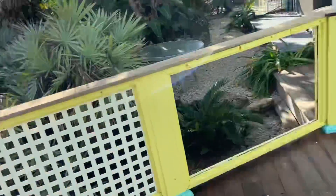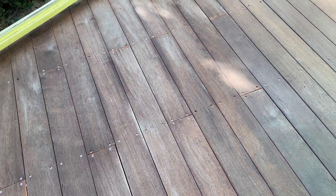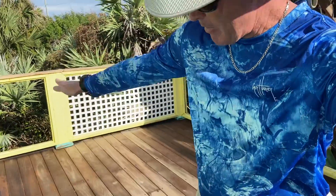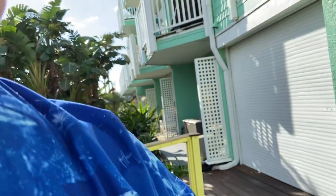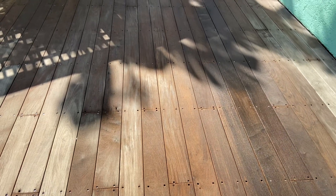The metasilicate just makes this wood look brand new. Now this is a Brazilian hardwood — it's very hard and you don't want to run a pressure cleaner on here, because even if you're doing a sweeping motion, you don't want any stop-start marks, you don't want to fur the wood. You want to make this wood look absolutely beautiful and brand new, and that's sort of what we have done here today.